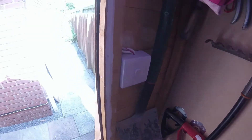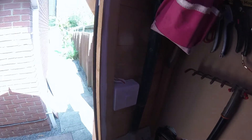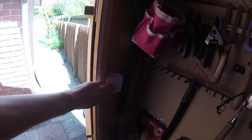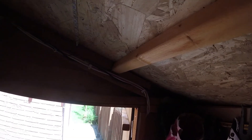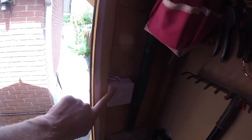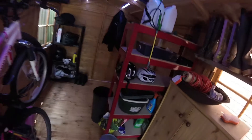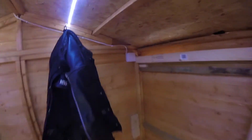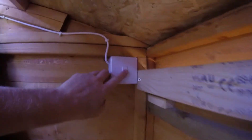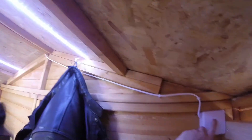And you need a light switch to turn the thing on and off. I've gone for a two-way light switch because I've got two doors in the shed — just on and off. A really cheap back box and a two-way light switch. The other light switch is down this end of the shed, but either light switch will turn the lights on and off.